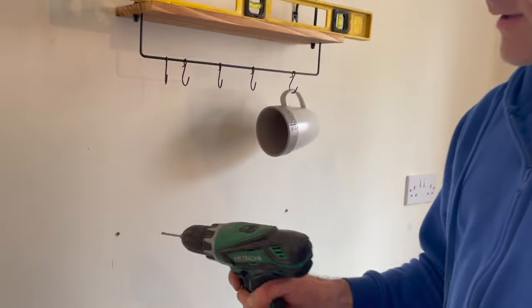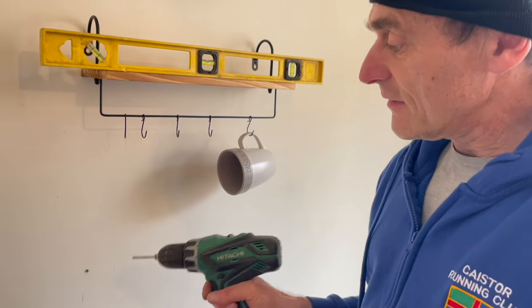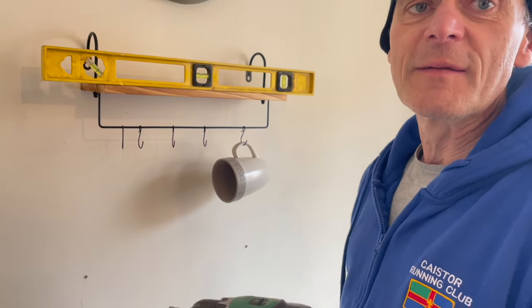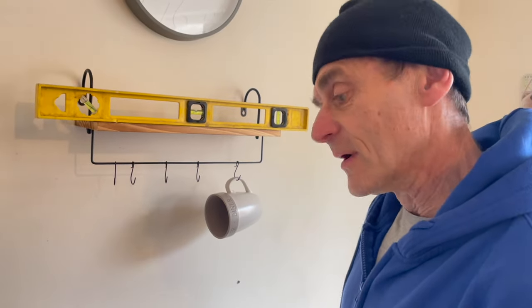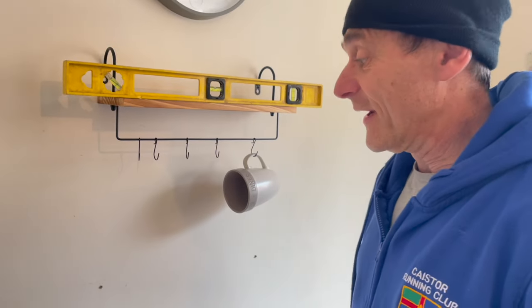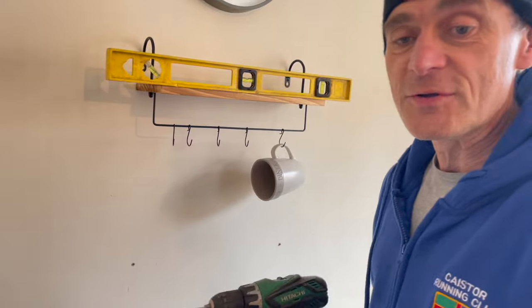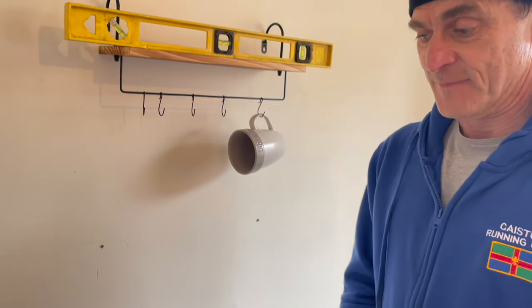I'm just saying that obviously you've got to get it level, but then you always want to drill it with a smaller drill first, because if it runs off a little bit, when you open the hole out, you can then move the hole slightly by angling it to bring the hole square again. So always use a very small drill. Plus, if you do get it in the wrong place, you've still got a chance. You've got a small hole you can fill and redo. So small drill and then work your way up bigger.